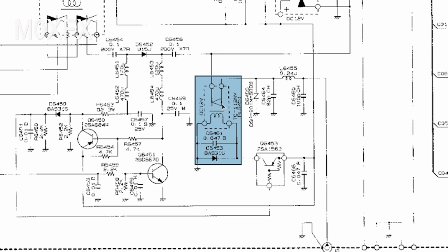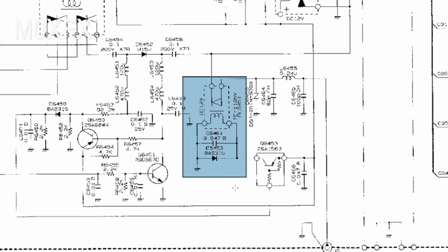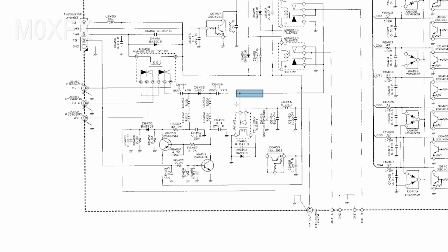I did do some calcs on these resistors, which I'll get to in a second, but this should be switching off. And I think that 1.4 volts is the smoking gun, because it's pulled this in or made it close to pulling in. And once the RF, because remember, this is a 200 watt transmitter, that's quite a bit of power. And if that's come down through this reed relay, it's gone off down into the front end of the receiver and done all that damage that we've spent all the time sorting out.